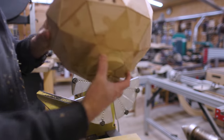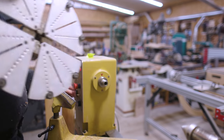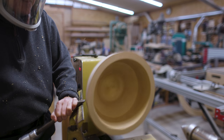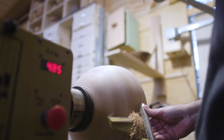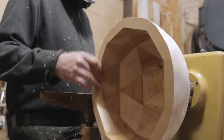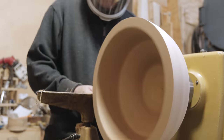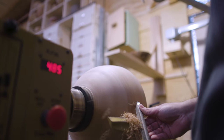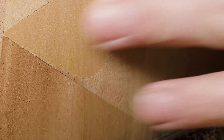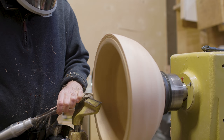Then I can put different chuck jaws on and turn the bowl around. Now I can do the main turning. I started with the outside. With a setup like this it's fairly round to begin with and it's all the same kind of side grain, so the turning is pretty easy. It starts out a little bumpy and then it gets smoother. If I rotate the bowl gouge and use the side at an angle I can get a very clean surface — I can pretty much get away without the scraper on the outside. The inside I still use the scraper. Then I can do the rim.